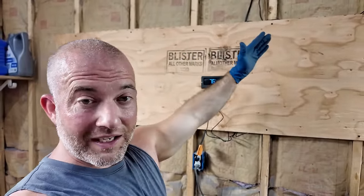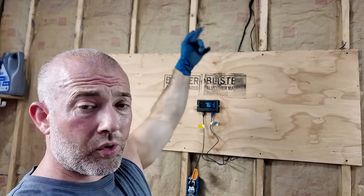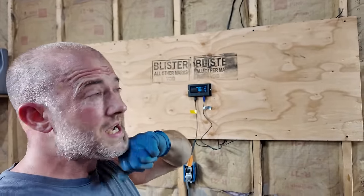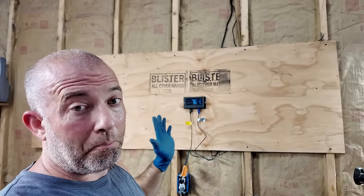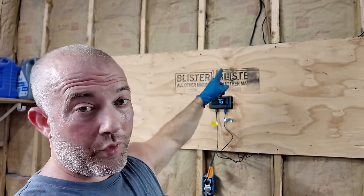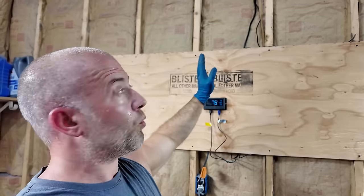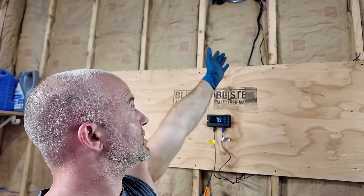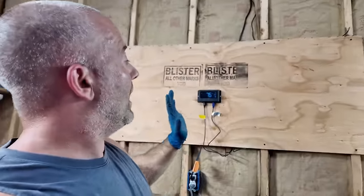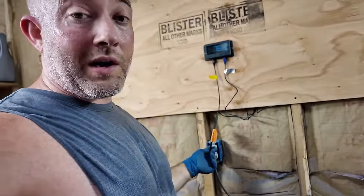I had to shift it into place. I put outdoor weather seal on the whole inside of it, and then I went outside the garage and sealed the whole outside. You could put this in with bolts and have somebody else outside put the bolts through and tighten them up. I put rivnuts in the sheet metal and then just ran the bolts in with lock washers on them into the sheet metal itself, and it's sturdy as can be. I wanted it up about as high as I could get it, and that's as high as I could go with the power cord without running an extension cord.